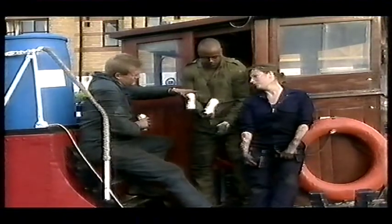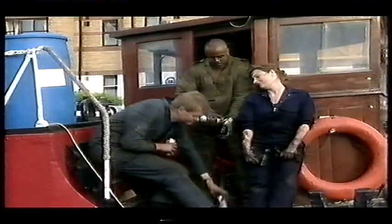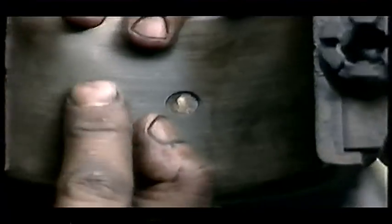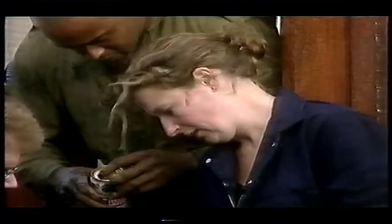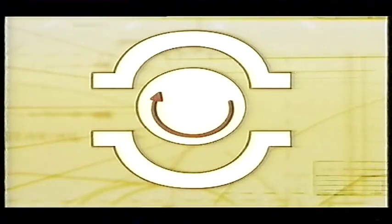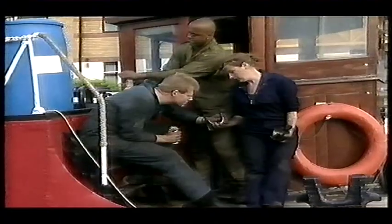The engines are in a lot more bits than they were, but we're winning. Apart from the bearings — that's what we found. This is the best one: there's plenty of white metal on that, but that thing is absolutely through to the copper. Each of the bearings should have a coating of white metal between it and the crankshaft itself. The idea is that the softer white metal will wear out instead of the expensive components — and our problem is that the white metal is long gone.